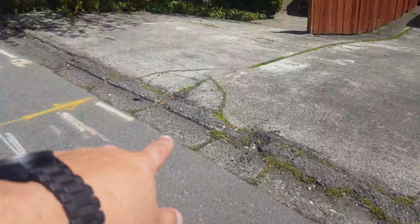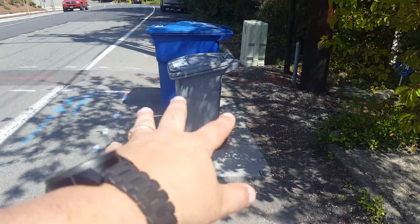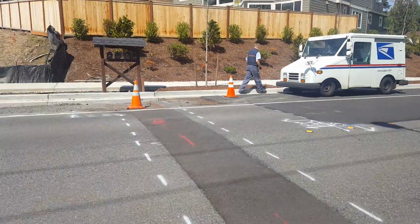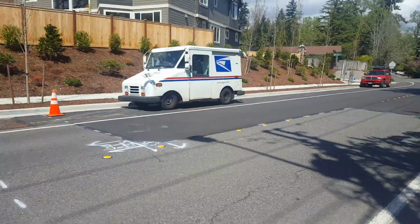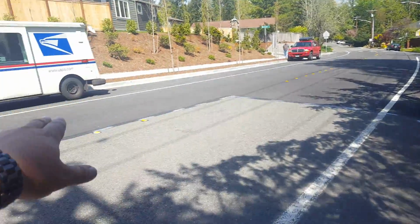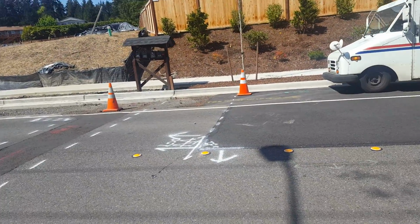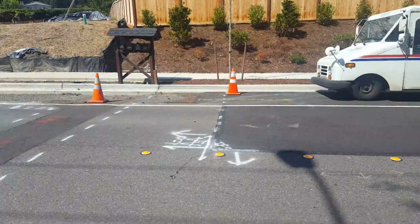We'll go right up to this old concrete curb and gutter. Here you've got the cold patch that we need to take out and replace before the grind and overlay. You've got that there. We've already got all these measurements. And then you laid out for the grind and overlay right up here against the new paving. One thing he also did is he just went straight shot over, and then we'll fix that area too.